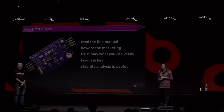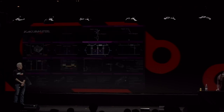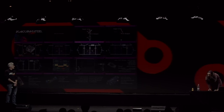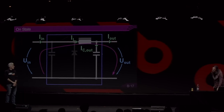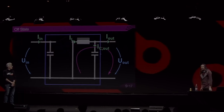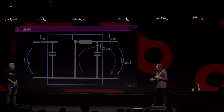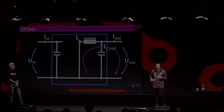What would you say the choice is between a discontinuous mode or a forced synchronous mode? That's a very good question. All right. So when I talked about this briefly and mentioned the synchronous converters, with forced synchronous converters, you have a controlled switch, and those have typically fixed switch frequency.